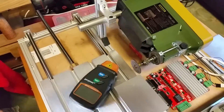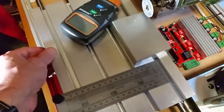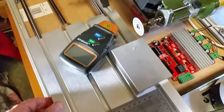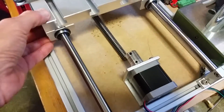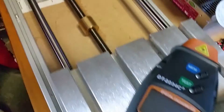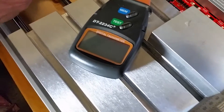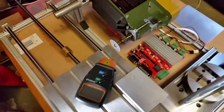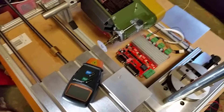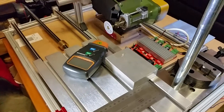So that's how far we've got so far. The job to be done is to extend the rail — even just to use it manually at the moment I can only go so far across, but with the full bar it will allow me to go the entire width of the table. I can move it manually in the X direction and automatically in the Y direction at the moment. We're also waiting for pillar mounts and a bearing mount for the lead screw block. All in all it's not bad, and so far it's about 300 pounds, which is considerably less than a commercial CNC machine. Ultimately we'll rely on this to cut most of the jobs for tool making and woodworking projects.